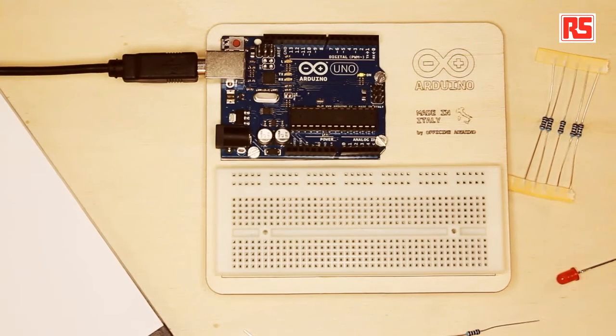How do we make the connection? You can take wires and wrap them around to create circuits, but it's not very practical. If you want to do a lot of experimentation, move components around, and try different kinds of circuits, wrapping wires around is not the best idea. So we're going to use this component called a breadboard. The breadboard provides a set of pre-arranged connections — each one of these holes is connected underneath with a metallic spring. When I plug a wire into the breadboard, the spring holds onto the wire and connects it to all the other holes in the same line of holes.